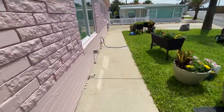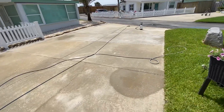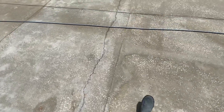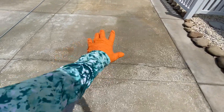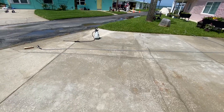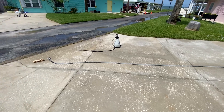I buy my oxalic acid in bulk. Isn't that beautiful — this looks gorgeous, this was just black. The whole driveway still needs to be rinsed; there are other areas we're going to treat. You can see some of the heavier spots starting to dry now. We're going to wet this driveway, reactivate those salts, and get it all nice and pretty. Mix up your oxalic acid in a pump-up sprayer, lay it on heavy but not running, and then let it dry — it's a three-stage process.